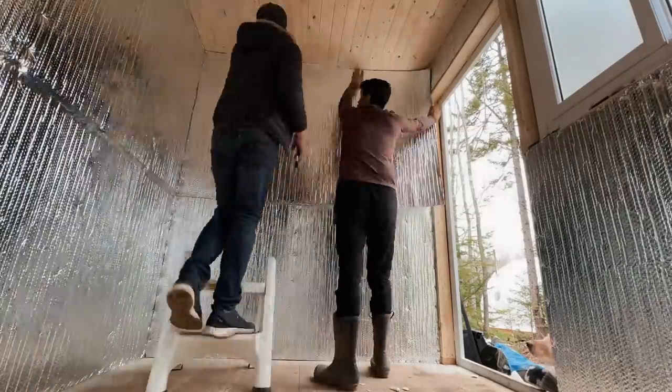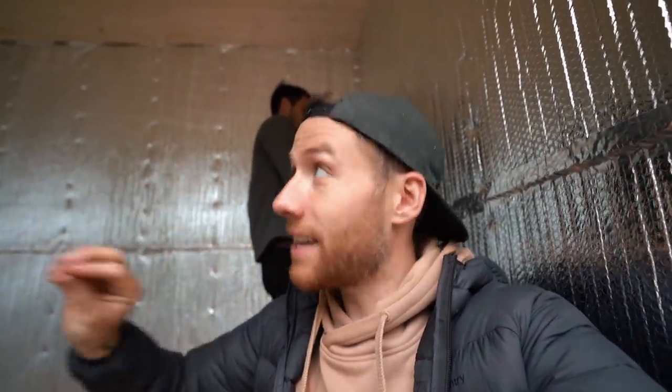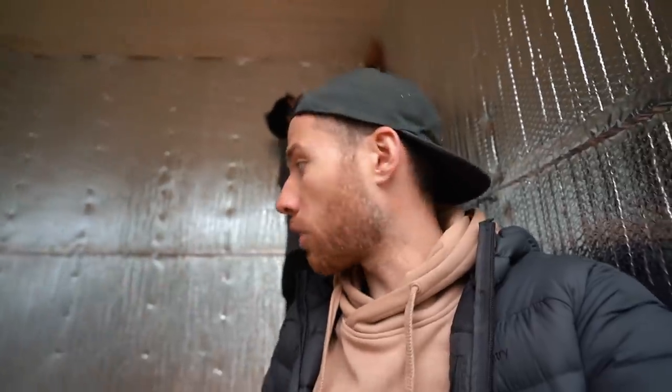All right, so after a lot of back and forth and deliberating, we decided to press on and continue with this today, even though we've accomplished an incredible amount. Todd did make a really good point. If we take the time now to fill all the holes from installing the ceiling panel earlier, we'll be able to give it time to dry so we can sand it and then put two coats of stain. So tomorrow we can just install the shiplap and that's gonna go really smooth.